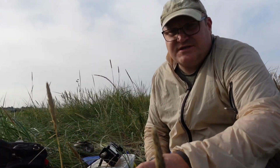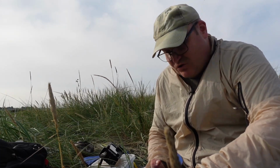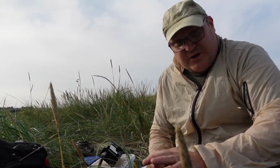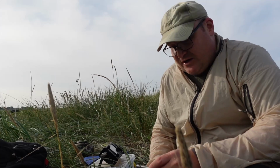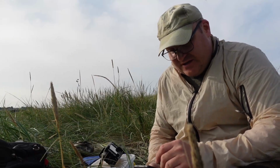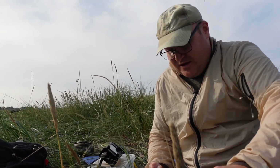The contest is open only for Scandinavian operators, which means Norway, Sweden, Finland, Denmark, Faroe Islands and Iceland. If you were on Bouvet Island, I'm sure you could get in as well, but that's a bit too far for this. Everybody that calls CQ has to be portable, but you can call in as a stationary station, but then you cannot call any kind of CQ. Operate on CW or SSB, or both of them. And you can operate on very short or narrow areas of the 80 and 40 meter bands. So for 80 meters, which I'll be operating on here first, it's 3600 to 3670 kilohertz. And 40 meters is 7060 to 7130 kilohertz.